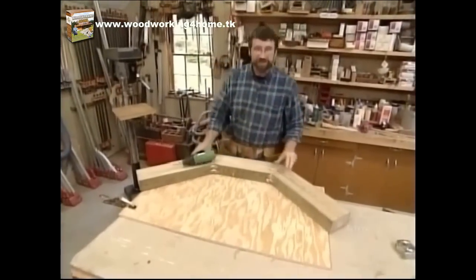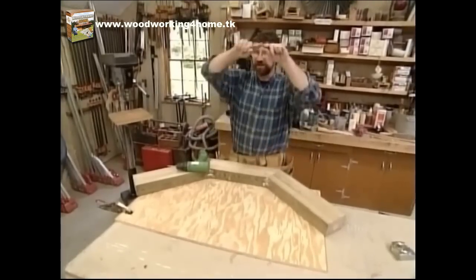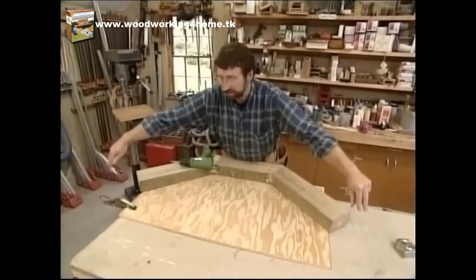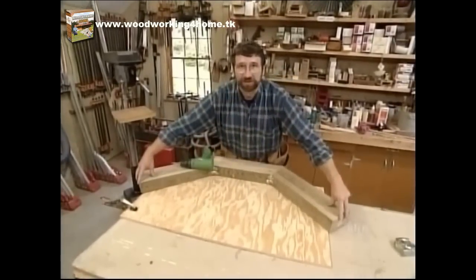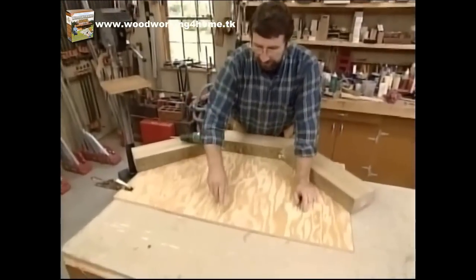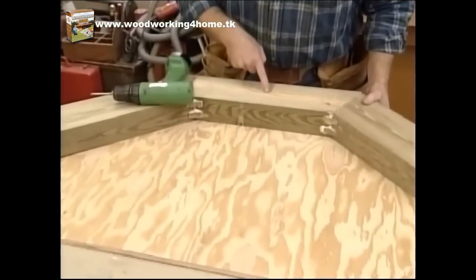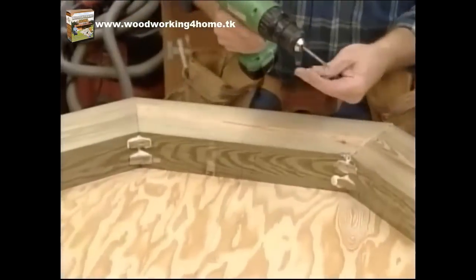Now I'm ready to start forming the arch for the top of the gate, and I'm going to have to use a different jig than I did for the arch in the gateway. In the gateway I started with a semicircle blank so I could put a cleat along the bottom. This only has three segments and I have no place to attach the cleat, so instead I'm using a piece of plywood. I've drilled a pivot point and put two perpendicular lines, brought the perpendicular line to the center of the blank, and now I'm attaching it with some screws and we'll cut it out at the bandsaw.